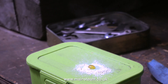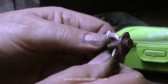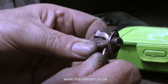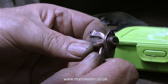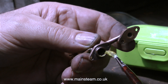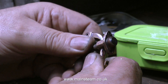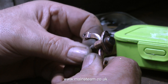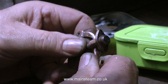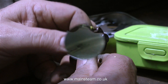I'm using some stuff called Time Saver, which is a lapping compound. The first one I used was the coarse grade and now I'm using the fine one — you just run it back and forth like this with some lapping compound in place. After a while I wash off the lapping compound and apply a new amount. I looked on eBay to see the price but it put me off a little bit — I think I'll just stick to the fine grinding paste you get in the tins, with coarse grinding paste at the other end, and then use T-Cut. I have nothing against this Time Saver stuff — it really is very good — I just never do enough lapping to make it worth buying.